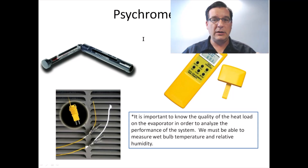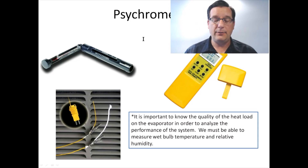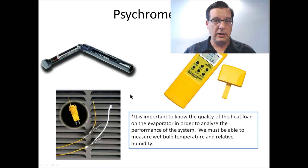The drier the air is relative to the amount of moisture it can hold — and there's the term relative humidity — the faster the water will evaporate on your finger and the colder your finger will get. That is the concept behind the wet bulb thermometer. By putting a moistened thermometer into an airstream, the water evaporates off at a specific rate depending on the relative humidity, leading to a wet bulb temperature. Combine wet bulb with dry bulb and you can calculate relative humidity, dew point, enthalpy, total water volume per pound of dry air — from the field of study called psychrometrics.